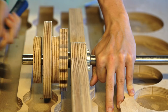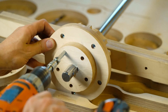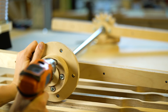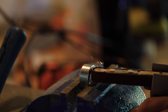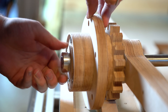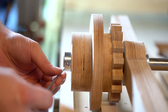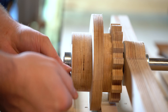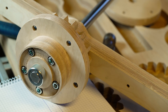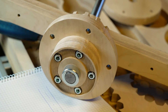Here I'm assembling the flanges on the shaft that will later hold the gear. The middle part is special — it's a key we can remove and put back on, because for every concert we need to disassemble the machine somewhat. We're building the machine in seven major sections, and when disassembling, this 112-tooth gear will come off every time. We were super happy putting in that last screw, and now we're already trying to fix a better solution.